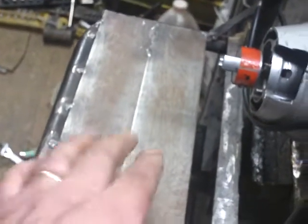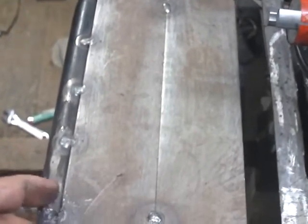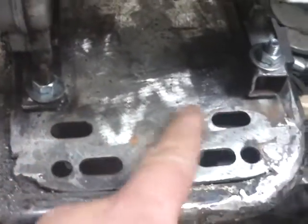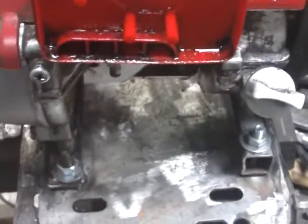Got the deck built for the generator head — just used some two-inch flat plate and tack welded it in for now. Just basically fabbing this up rough and then we'll go from there, solid it up and do some paint. This is all just rough metal with grinding marks — just the fabbing-it-up stage to see how it goes.